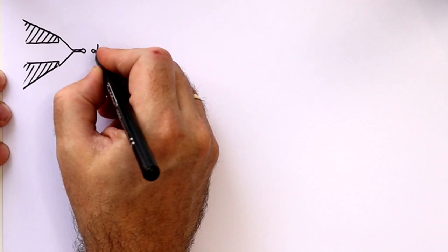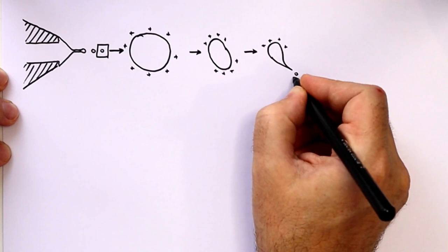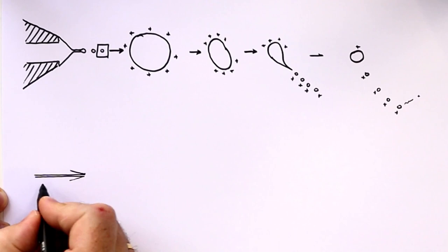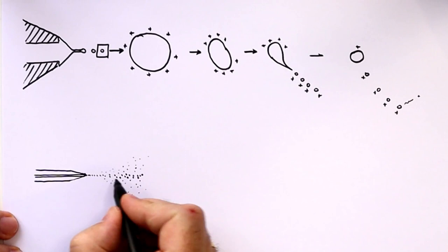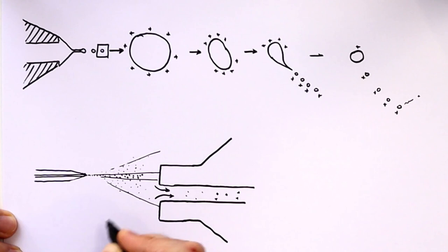This brings me to the position of the emitter. To answer what the best position is, let's analyze the anatomy of the expanding electrospray plume. The jet breaks into droplets that evaporate and shrink in size. When they can't retain their charge, these droplets explode — those explosions are called Coulombic fissions. Coulombic fissions produce much smaller, electrically charged droplets which then produce the ions, but they also produce large droplets with little charge — I'll call those zombie droplets. The zombie droplets stay in line with the jet because they have a lot more inertia, while the smaller droplets and ions are repelled more rapidly and deviate from the axis of the jet. The result is that the central part of the spray is full of zombie droplets, and the outer region is rich in nano-droplets and ions.